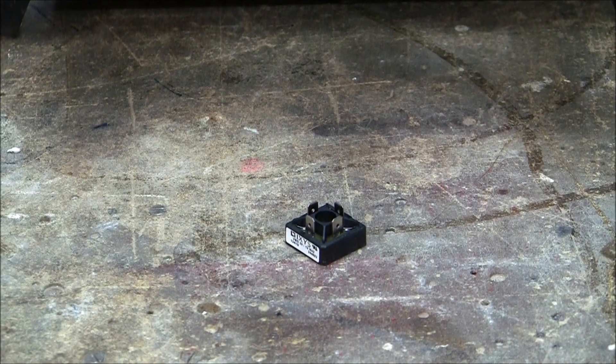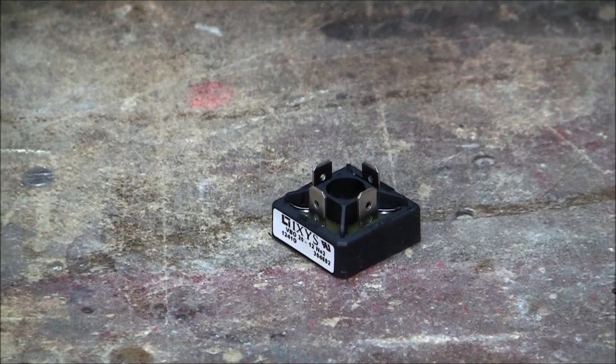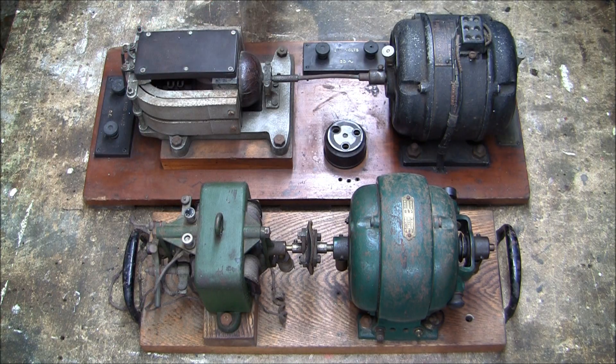And that whole machine now has been replaced by one of these. From the late 19th century, rotary converters were also used for rectifying AC to DC. The two here are very small compared to the units on, say, the New York subway, but the principle is the same, in that it is essentially an AC motor driving a DC dynamo. You can see the disadvantages of this immediately, in that you have a mechanical moving part that wears out and needs maintaining.